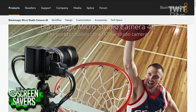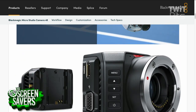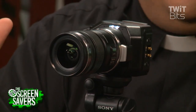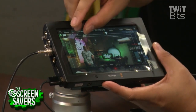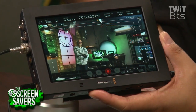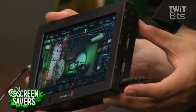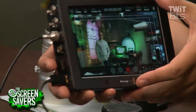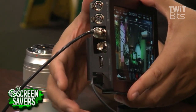What this allows me to do is output to both simultaneously at different resolutions — I can output to the SDI at 4K at the same time it outputs 1080p over HDMI. Why do you need both? For example, if I want a monitor so I can see what the camera is filming — because it has no viewfinder either — I can put a monitor next to it and still record in 4K. That's what this companion device is: the Blackmagic Video Assist. It's a $900 device, not just a screen — it actually is a recorder. It's got two SD card slots and records in ProRes HD, which is what Final Cut uses. It will also record 4K and 1080p, and has many inputs including HDMI, so I've even recorded video game sessions off my console with it.